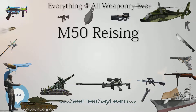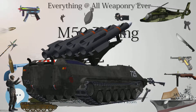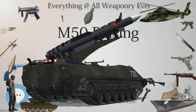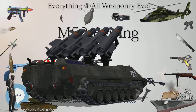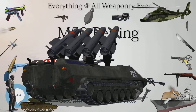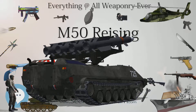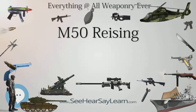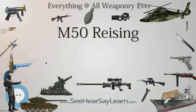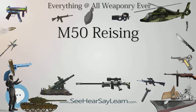There are three types of H&R magazines. The first and second models are both smooth-body, blued, and are 20-shot double-column. The first model is distinguished by five cartridge peepholes on the left side, a feature eliminated on the second model to prevent mud and sand from entering. In contrast, the third model is parkerized and has two long indentations on the sides to reduce its capacity to a 12-shot single-column magazine because of feeding problems experienced with former models.